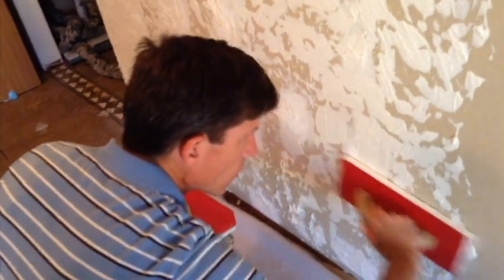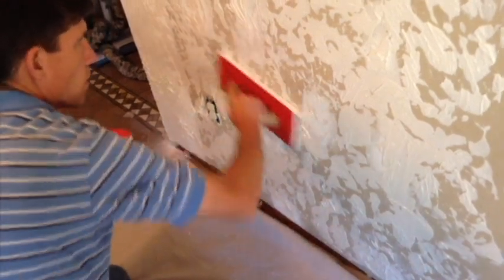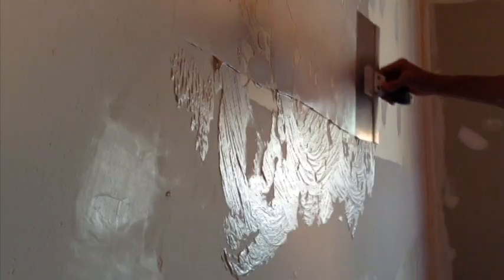Step 4: Using the small magic mudder, model number 660544, while the mud is still wet, spread the applied mud using a swirling motion. Then smooth the mud over with your 10 or 12 inch taping knife or trowel. Expand your texture area as you become comfortable with the process. For large areas, two people can work together — one applying the mud to the surface, the other spreading the mud with a small magic mudder and smoothing it with the knife or trowel. Tweak the texture to your liking, putting more or less mud on the wall or ceiling to get the texture just how you want it.